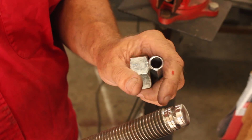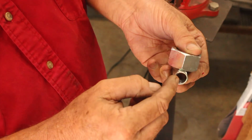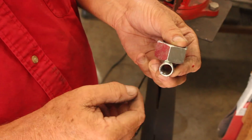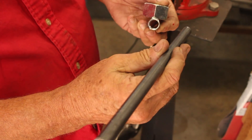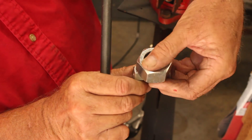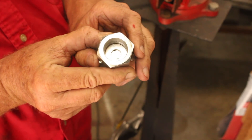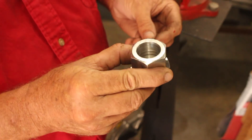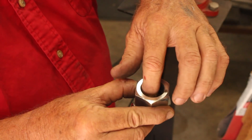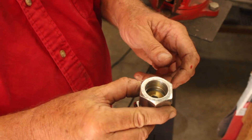Here's my end with the groove cut in it. The receptacle is a one-inch nut that I bored out, and a half-inch coupler nut bored out with a half-inch drill bit. We'll put a half-inch bar through that and bend it - this will pivot as the angle changes, because as the screw goes in and out the angle relative to its anchor point will change. We'll weld this up, then drop two brass toilet washers in there to make a little thrust bearing, put some grease in, and put it all together.